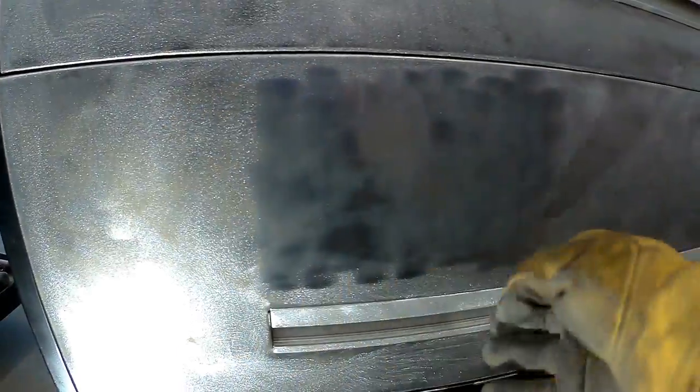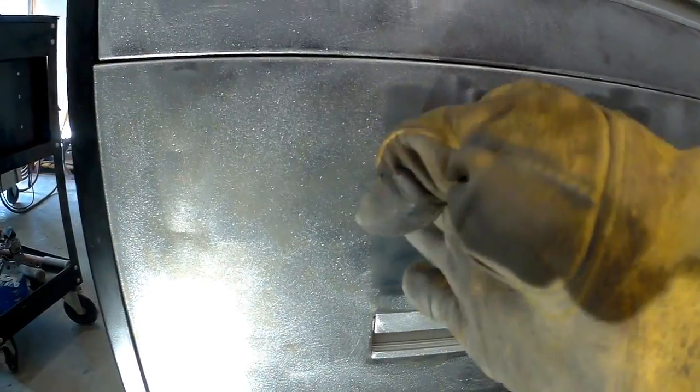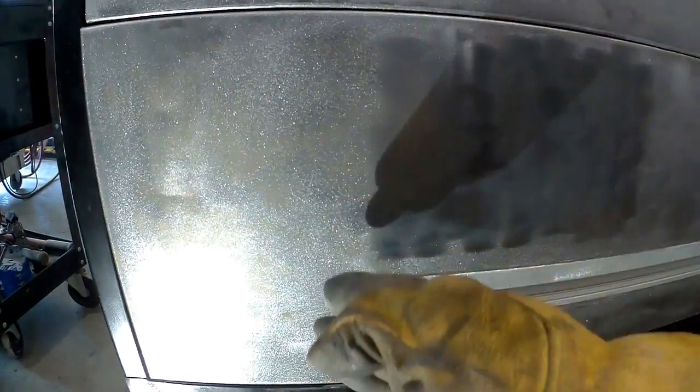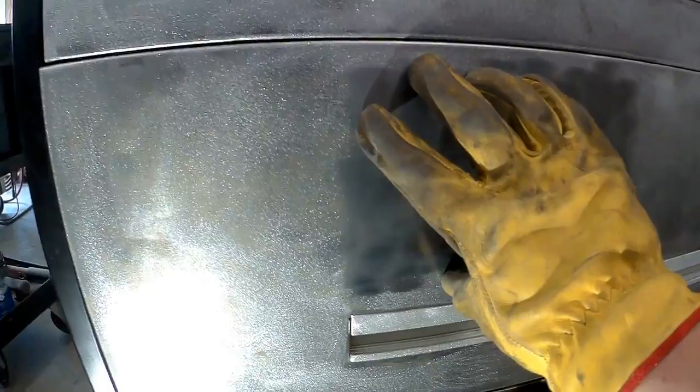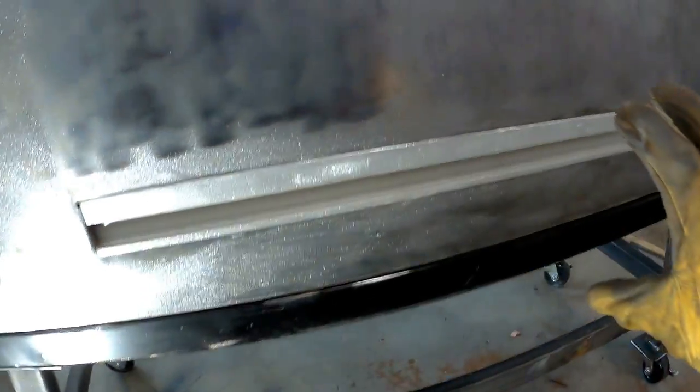But also this will show your swirl marks or a grain. So if your wheel's spinning this way, it's going to be pushing all the grain like this. So if you all of a sudden turn that grinder and start going this way, you'll get a different kind of reflection off of the light. So you've got to be really careful when you're doing that, you keep that wheel always facing in the same direction, same orientation as you go through here. Otherwise, you'll get a lot more splotchy finish than what you got right here.